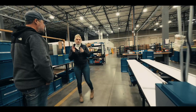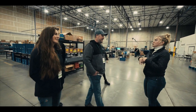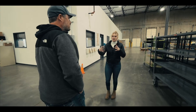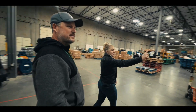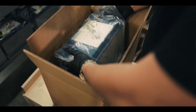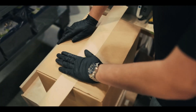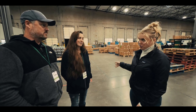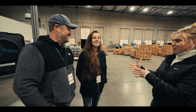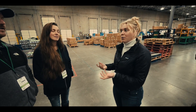Here is where you get your lid on. It'll knock that seal onto there and then they will epoxy each one of your terminals, so now you have your red and black terminal. Then we'll sticker it the next day — these usually have to sit overnight. Once these are sealed, they will not be opened again. They're stickered, they're bagged, and we take them over to the boxing station. We know that FedEx and UPS just toss things around, so we actually have a foam mold we make for each battery. Our batteries have to ship as hazmat material, so we have to make sure we get that shipped in the right time frame.